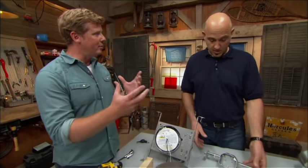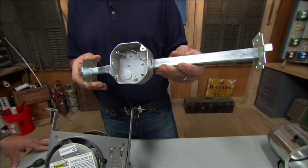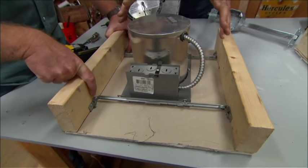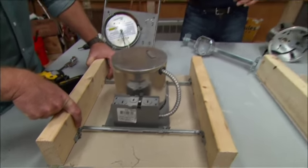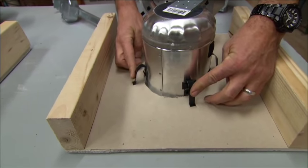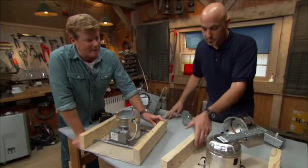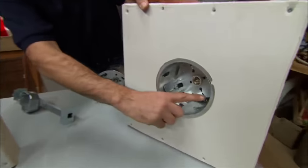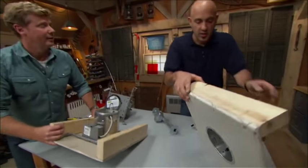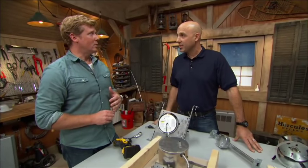Don't fans usually need a special box because of the weight and movement? This is a special box — it's a fan and heavy light fixture box. It has these bars that tie in directly to the structure itself. So we can put it in this can because we're actually tied into the joists right here at this connection. This is a new work recessed light where these bars tie directly into structure. However, you don't always have a new work fixture. This is an old work recessed light, and you can see there are no bars — these tabs are the only thing supporting this recessed light, to the drywall. These four tabs indicate it's an old work fixture, and you can see those from down below. So if you see those tabs, you can't use this retrofit kit. The kit works on five-inch and six-inch recessed lights — not the smaller ones.